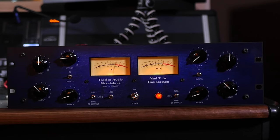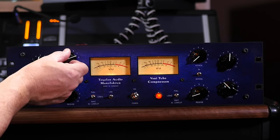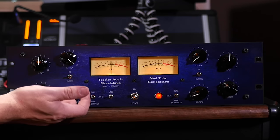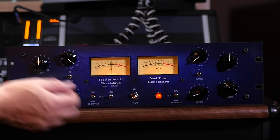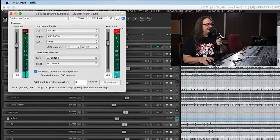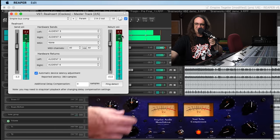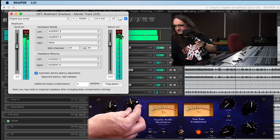This is a great spot to put the link button to the test. I'm going to leave the attack down on one side, then roll one back and show you exactly what's going on — linked and unlinked. That's definitely doing something with the attack on both channels. In my experience with analog compressors, just set everything at the middle and it's usually going to sound pretty good — that should always be your jumping-off point, set everything to five. We have to level-match the left and right here; the link button only seems to be for attack and release.